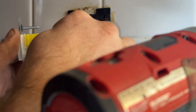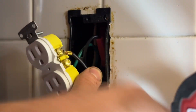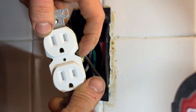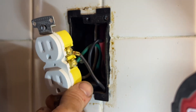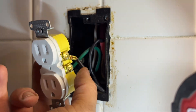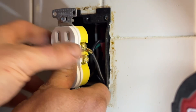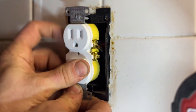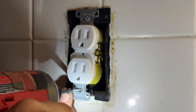Don't over tighten these. If you're trying to set up separate outlets that are powered off of their own power source, there's a little bitty ear in here — a little bitty nub that connects that hot and that hot. You can break that nub on both sides on the hot and on the neutral side, and then you can connect a leg of power coming into the bottom that'll power the bottom receptacle and a separate leg of power on the top. A lot of times people do that if you've got a switched outlet — like a garbage disposal, you may put it on one of the plugs and have the other plug live all the time. Normally there's some wire work to be done in there, but this one doesn't need it. Always make sure all your nuts are tight.